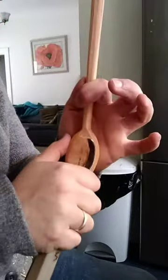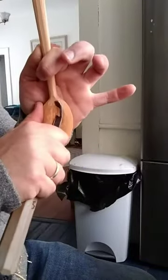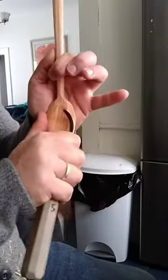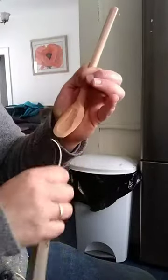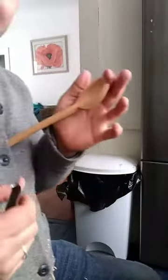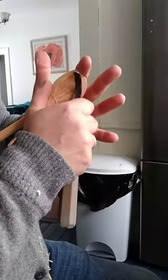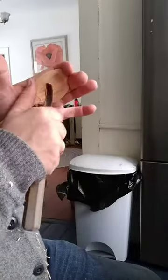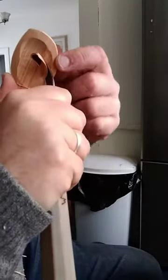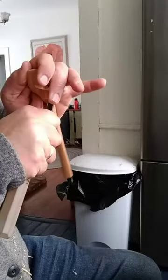So thumb is on the side and I always do the same opening cuts from the neck down to the tip of the bowl. And I usually do the center to the sort of the center side. Now I flip it around, I brace it against my chest and I pin it with my finger. Same deal. I put my thumb on the opposite side and I do cuts that go down the side of the bowl here that are going to address this side here, but I'm still staying away from that edge. I finish those cuts by swirling across.